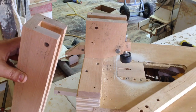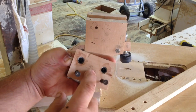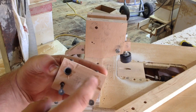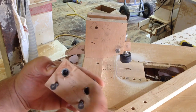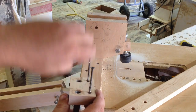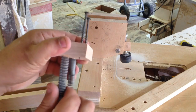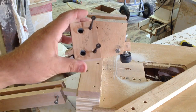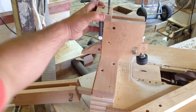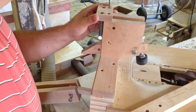Another little piece is the block the springs get hooked to — it's a three-inch by two-inch piece of hardwood with a couple of holes drilled in about three-quarters of an inch: three-quarter by three-quarter, half-inch holes for the little springs. Once I tensioned the springs, I pulled them tight and put a screw in behind, then ground them off so they don't stick out. Now I set that on the top, put some screws down through — I'm using long drywall screws, I really like them.